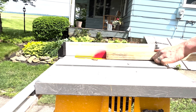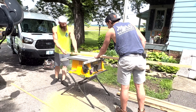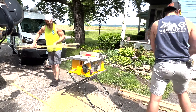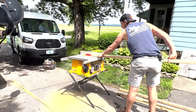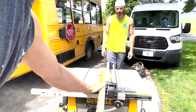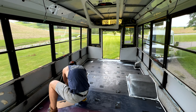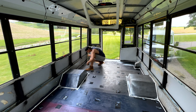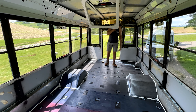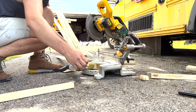Now we're getting into the framing. We need to frame out the floor because we're putting one-inch insulation all over it. We'll put bracing down, then plywood over top, and the insulation will go in between the joists. That's the project for today. My brother might stop down and help — if you see him, don't be scared, he's a nice guy.